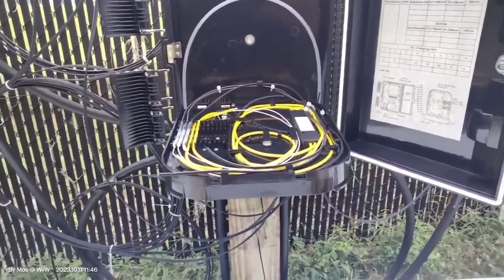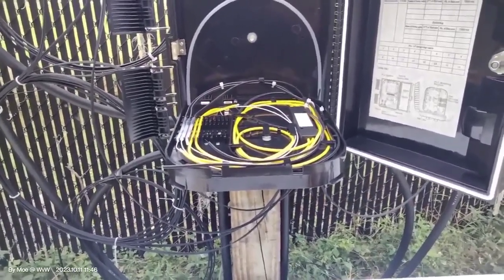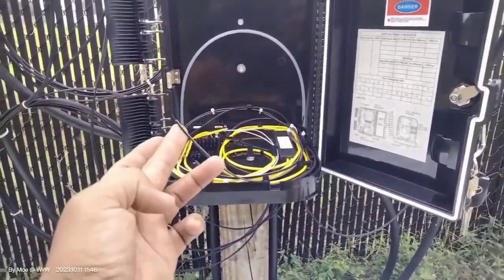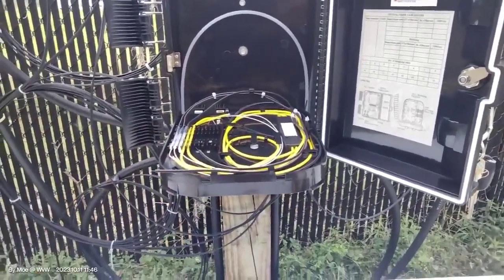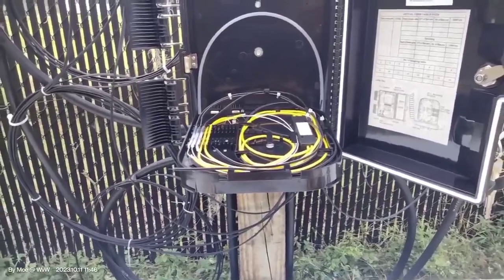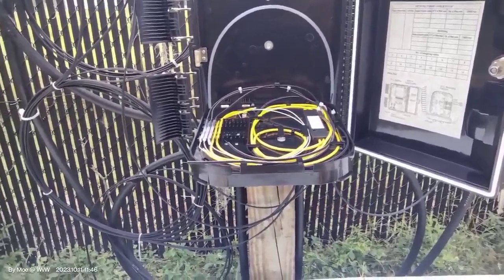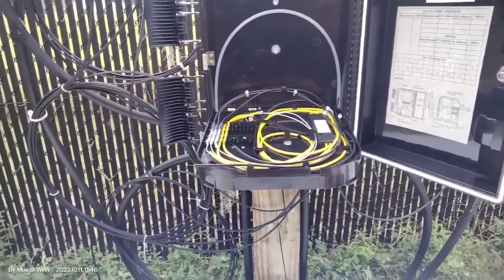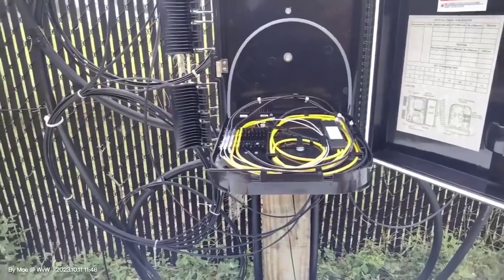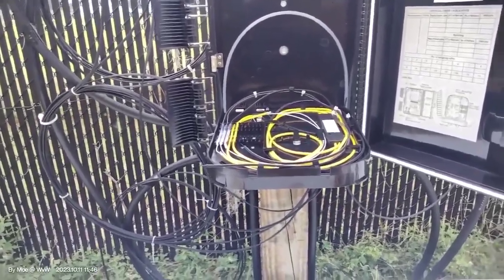The goal is two to three GPONs per day. That's not just installing the wire or the GPON — it's the whole setup: running cable from the main panel all the way to the location, installing the GPON, the box, splicing both ends, testing power, adding the right attenuator if needed, testing internet, doing the ethernet cable if the client is there, or just passing the cable inside and terminating it when they're ready.